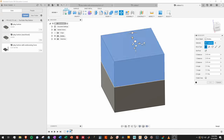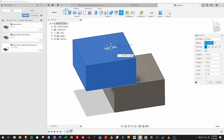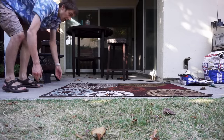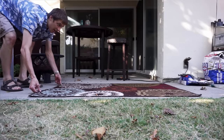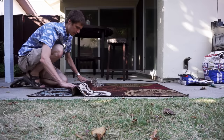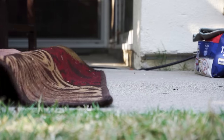Imagine you're trying to deform a cube and need to shear the top with respect to the bottom. If you drag the whole surface at once, it takes a lot of energy — that's like trying to drag a carpet across concrete. There's just too much friction. But if you can add a ripple to the carpet, that ripple can move very easily. And when it reaches the far edge, the whole carpet has actually shifted just a little bit. If you send a lot of ripples, you could get the carpet to keep moving along the sidewalk — without ever actually dragging it.